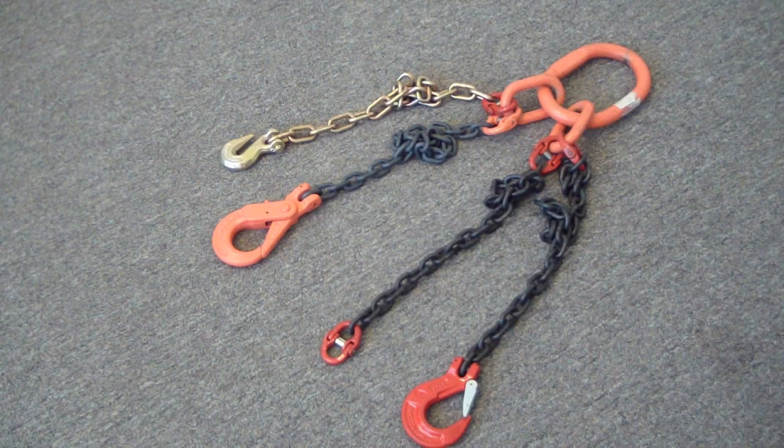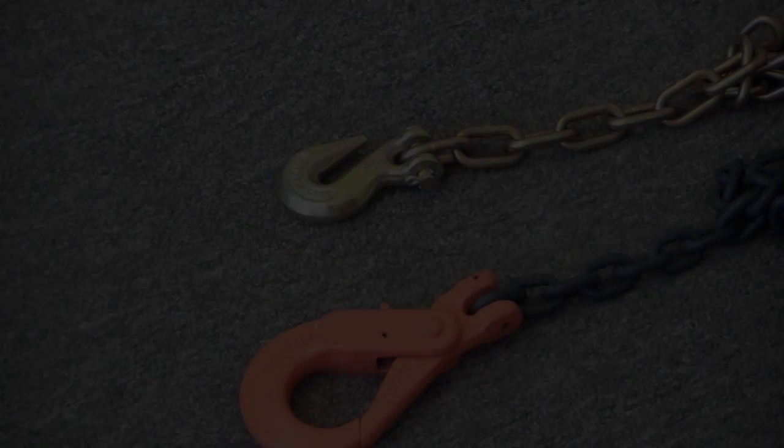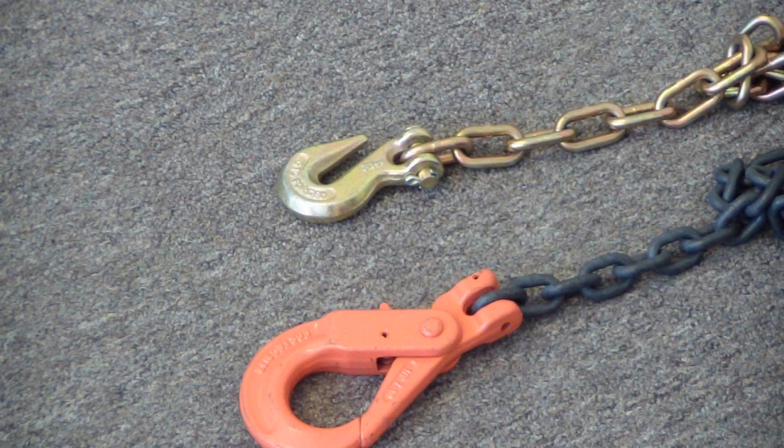This is a master ring with sub-assembly featuring a few different hook styles in various grade strengths. Featured on top is a clevis hook for transportation, suitable for holding a load horizontally. The clevis style is characteristic of how the load chain connects to the hook itself. This type of hook eliminates the chance of slipping by having the hook connect to the chain at a single static point.